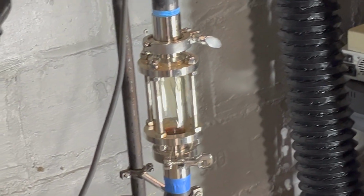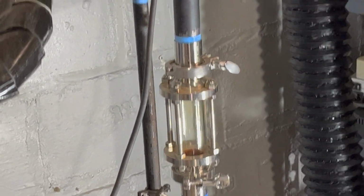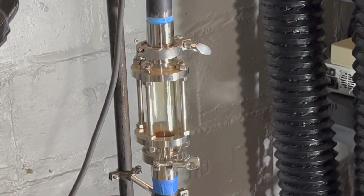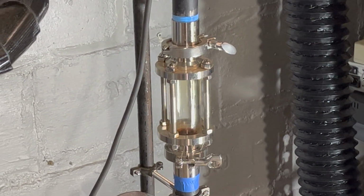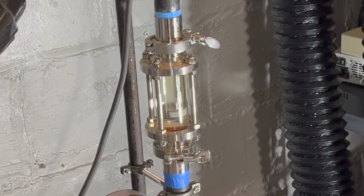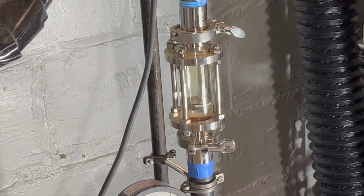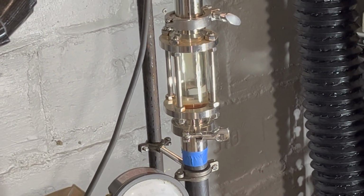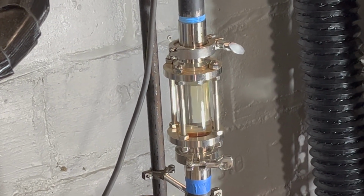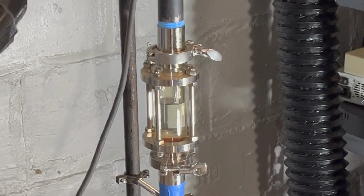Now, I don't want to do that because I did it once and it immediately shot water up to my main vent. No question. But here, I'll do it again. I'm slowly closing the valve, causing this pressure differential. The boiler now is higher pressure than the main, and it's causing the water level to rise, right? That's the action that I believe everybody thinks the equalizer is preventing. But it has nothing to do with it, folks. Nothing.